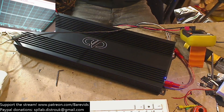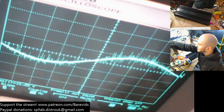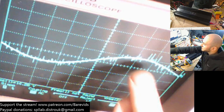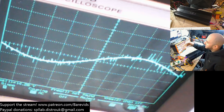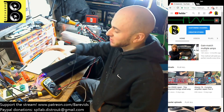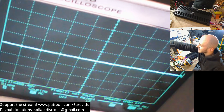So without further ado, let's get started with the bench test. I'm going to put it onto my scope view. We're going to slowly go up and you can see the sine wave change in shape. You can see what I mean by a slightly dirtier way of creating the sine wave — on the M series and even more so on class AB amplifiers, this sine wave doesn't have these jaggies on it. These jaggies are to do with how the amplifier is generating the sine wave. The subwoofer doesn't care about these jaggies on the scope — it makes no difference. Let's continue with the bench test and push this thing to full power.